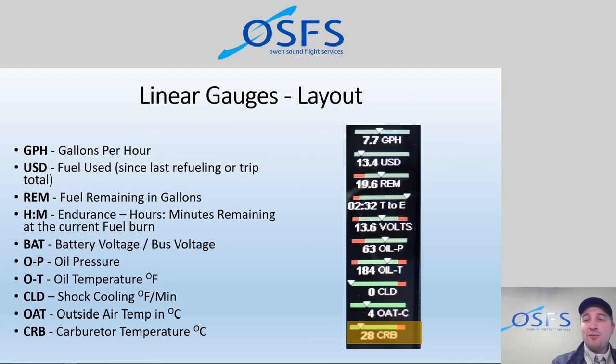So the carburetor temperature, Cessna's got that range, minus 15 to plus 5. That's the carburetor temperature, not the outside air temperature. And now we can actually see what the carburetor temperature is. What is it actually doing inside the carburetor? So aside from being proactive for carb icing by understanding atmospheric conditions, like high moisture days, what is it, minus 5 to plus 30 outside air temperature range.